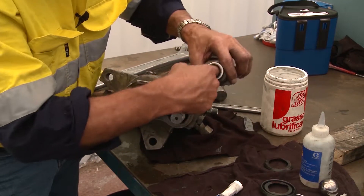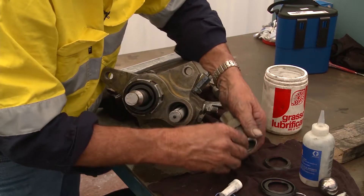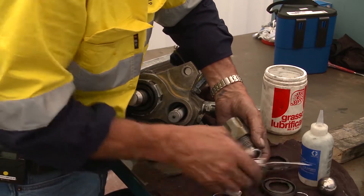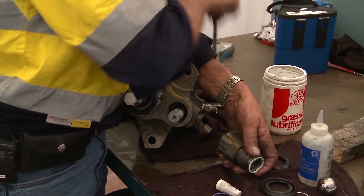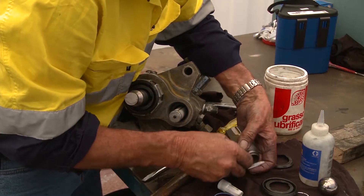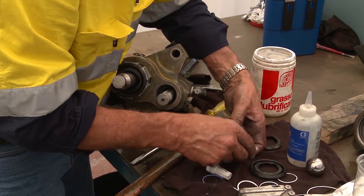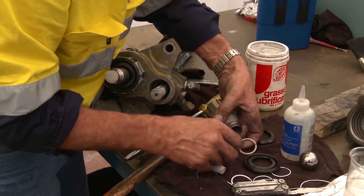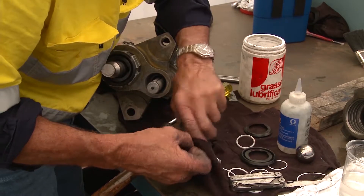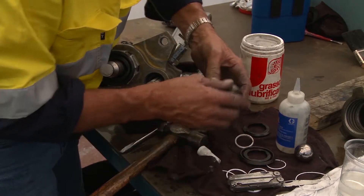Push it home — the spring inside this cap has to be free and able to push into the seat. In this kit you can replace the o-ring itself. The easiest way to get the o-ring off is not a knife, screwdriver, or hammer — all of those damage the ring land edge and pressure will escape out that edge. Use a small screwdriver or pick to get underneath and flick it off. Most will come off with your fingernails.